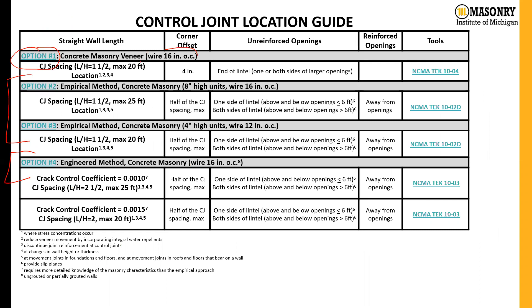As noted in parentheses, we have wire at 16 inches on center. It's worth noting that NCMA recently updated their tech note, so for half-high units — four-inch high units — the wire is required at 12 inches on center. If we think about a half-high block in a wall, there's essentially double the mortar in that bed joint, which results in a lot more shrinkage. Spacing the wire out at 16 inches on center creates more shrinkage potential, which could result in cracking. For the engineered method, it requires selecting a crack control coefficient of either .001 or .0015, and NCMA does allow linear interpolation for those as well.